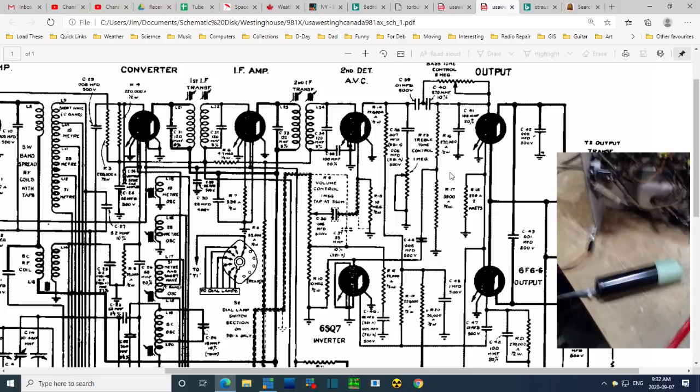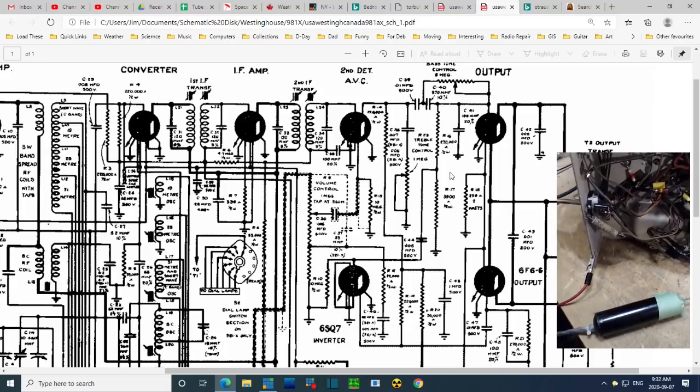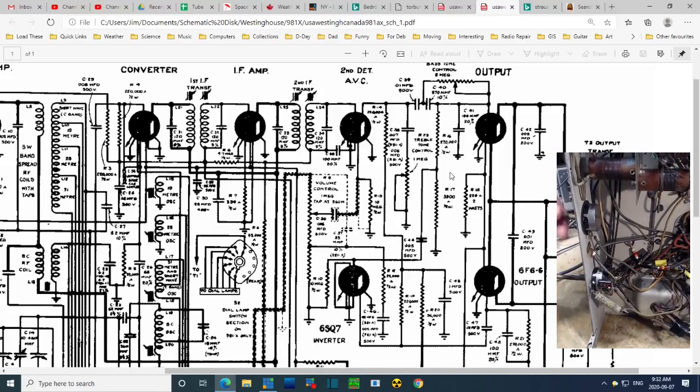Jim, don't forget, the 120 volts is right there, waiting for your finger to touch it. Careful here. Okay, so this one up here, a little unusual, it would just kill the sound entirely. So this is connected just as a variable resistor onto this wire, and I traced this wire all the way over to this terminal. I don't know if you can see where I'm pointing.